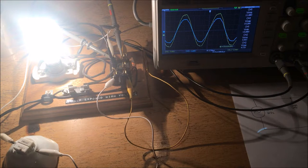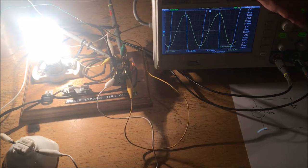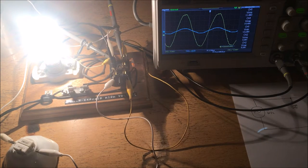If, for example, I were to connect our capacitor again — I have to note I can only connect the capacitor for a few seconds since it draws a lot of reactive power and I've already burned the table trying to do this experiment once. As you can see, we now have another waveform. This waveform is a little bit distorted because of leakage and parasitic effects in the circuit, but it is generally speaking leading ahead of the voltage curve. Now let me disconnect it before my resistors get too hot. As you can see, it was leading the voltage curve.